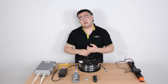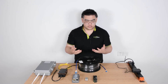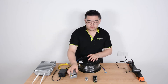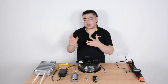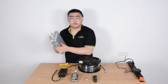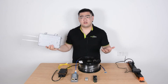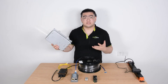So instead of trying to extend the POE signal, we can use something else, which is what we're going to talk about today — a fiber optic link. And since we're going to set this wireless access point outdoors, we're going to need this outdoor media converter. This outdoor media converter is also a POE device, so we can connect it directly to a POE wireless access point like this one, which is also an outdoor wireless access point, meaning it's waterproof. It's totally fine to leave it outside exposed to the rain — nothing can damage it, and it will keep getting constant wireless reception.